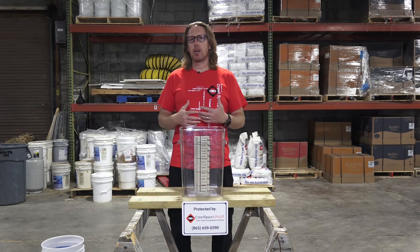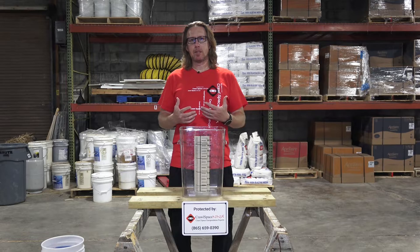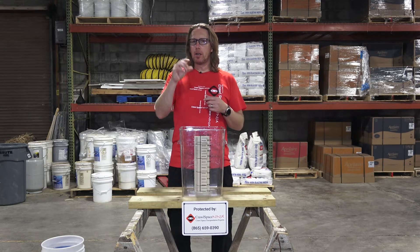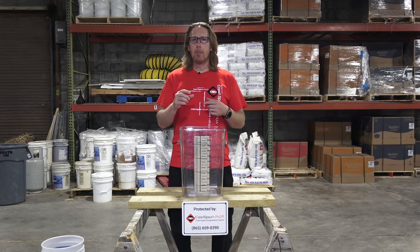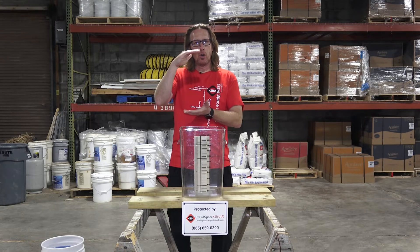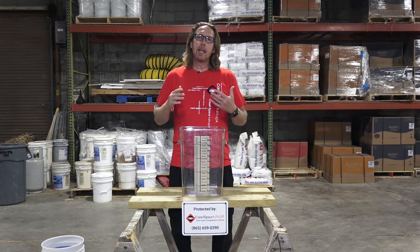There was a lot of stuff out on the market, and the quality just didn't seem that great to me, because a lot of times these basement waterproofers will go in and they'll barely bury something under a slab. They'll barely pour slab over so that way it's not to code. You've got to have about a three and a half inch pour back on code.